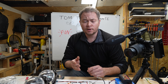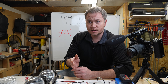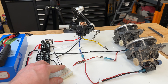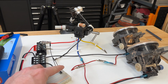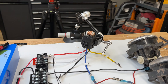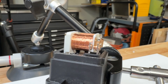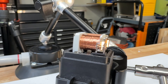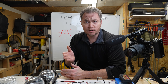Using the same setup as before, let's use the breadboard and this little momentary switch to demonstrate what that looks like when you pass electricity through the relay. You can see when I depress the momentary switch and energize the relay, the lights come on. Let go, de-energize, lights go off — on, off. Up close, you can see how when we energize the relay, that armature swings back and forth, closing one circuit or the other.